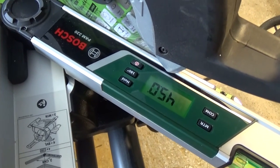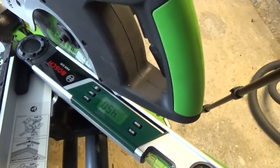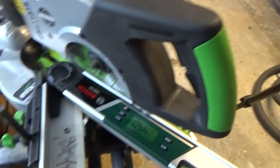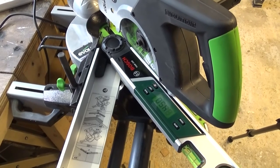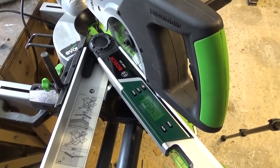To actually set the 45 degree angle up took me about five minutes. You've got to set the angle up that way, you've got to set the vertical angle at 90 degrees, and that's basically it for just normal miter cutting. In the instructions you'll usually find exactly what you need to do to sort out tuning the tool.